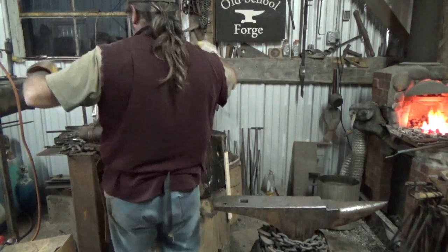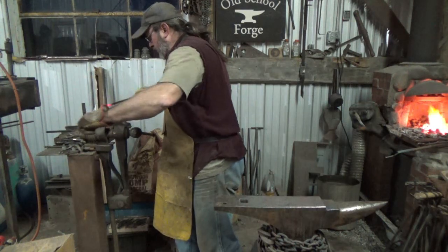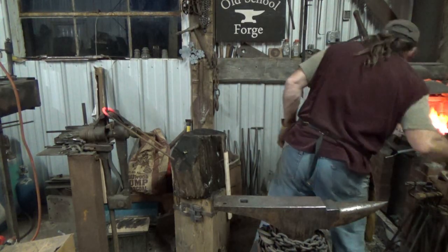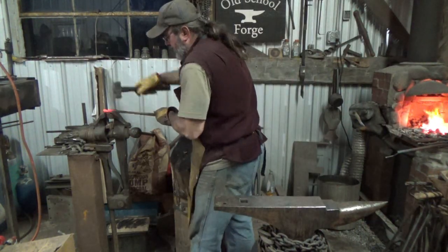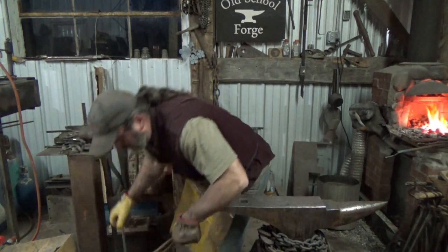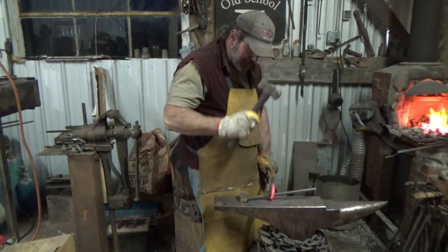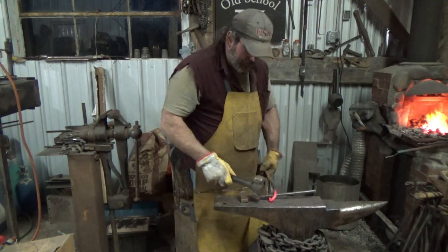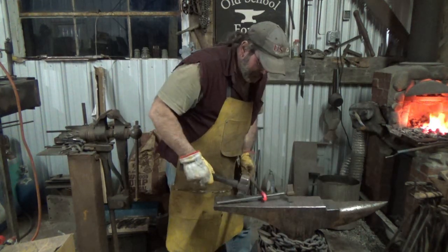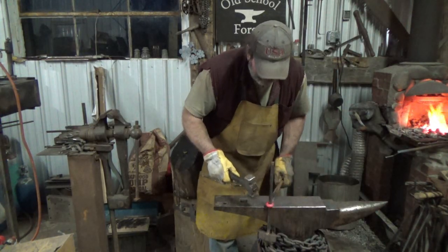Alright, so in case you haven't seen my handle videos, I'm going to go over the top. I usually take a piece of half-inch round, 3/8 or whatever the case might be, bend it around, another piece of half-inch. Oh, shit. Some days are just like that, should have stayed home. Usually I use 3/8, that's probably why I'm having a little more trouble than normal. So you want to hammer both sides to get that eye so it looks centered.